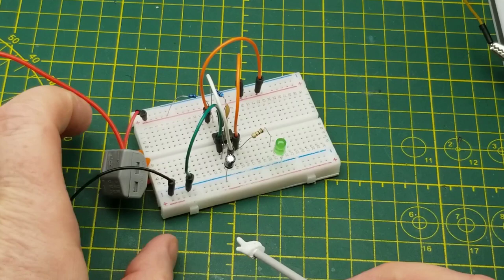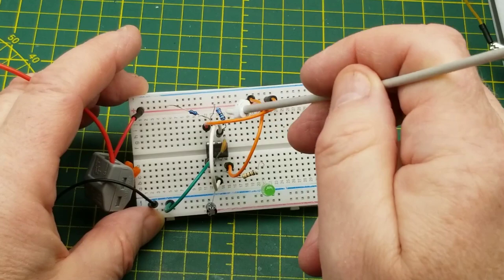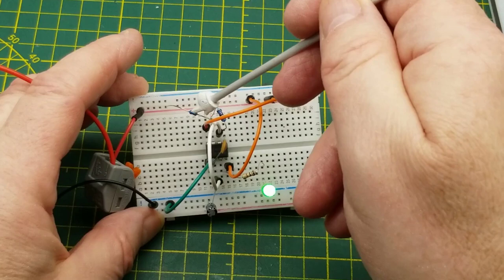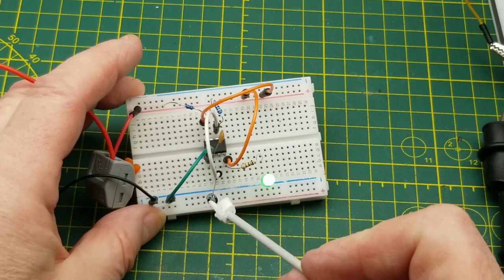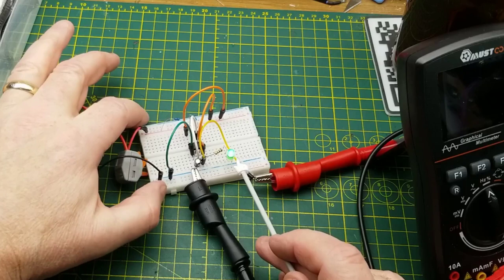So here is that astable multivibrator, aka standard oscillator, which is the one that we tend to use most often in hobby stuff. There is the two timing resistors up there. This is the discharge resistor, and this is the one that is used in series with it during the charging. Here's the timing capacitor, and again, there's the bypass capacitor down there, LED and its resistor here. So without having done the math, we can obviously see that this is not running at a 50% duty cycle.